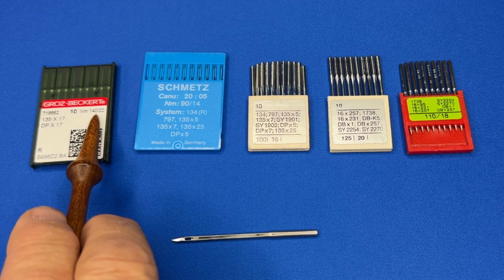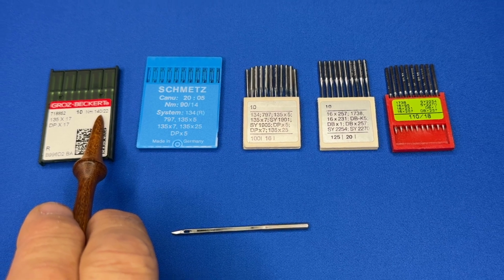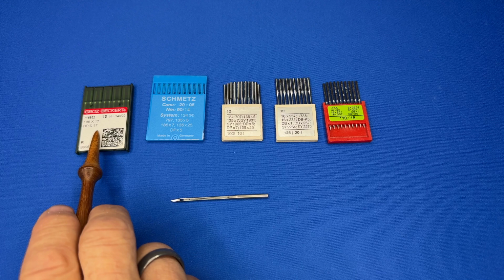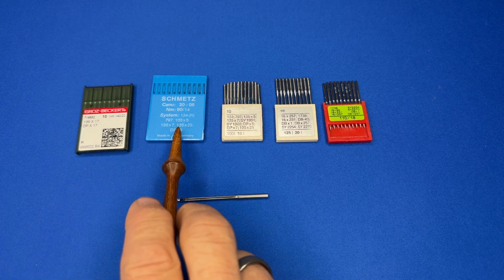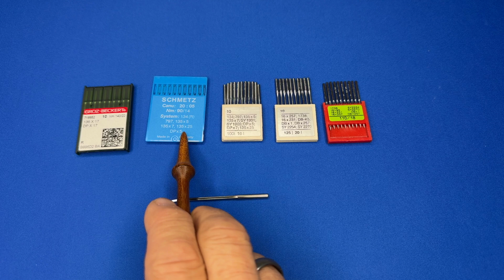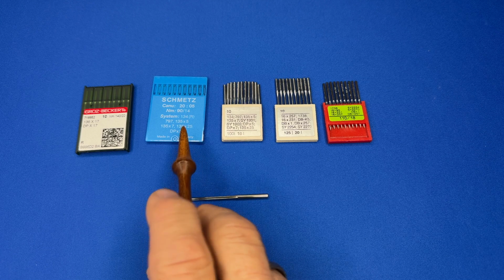A little bit too light means you can flex and break needles, and the broken needles and the flexed or bent needles are what cause the damage to most machines that I see for repair. This needle system fits most upholstery class machines. This needle will fit most quilt machines that are set into tables permanently. That's what this needle mostly is for.